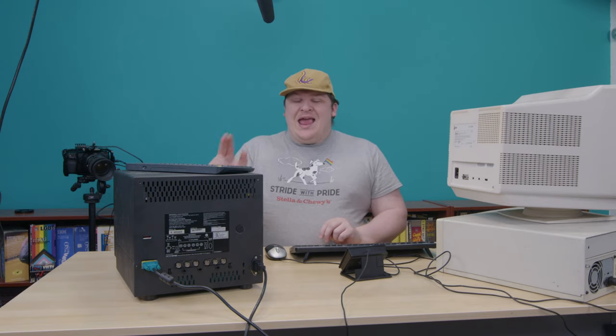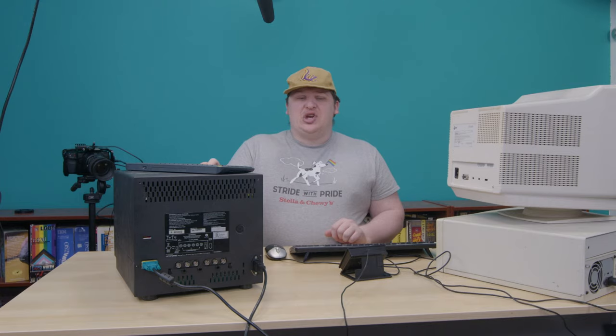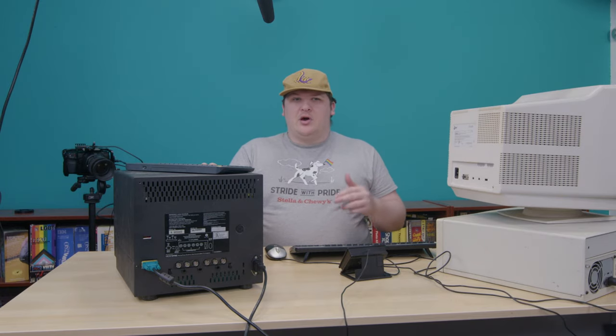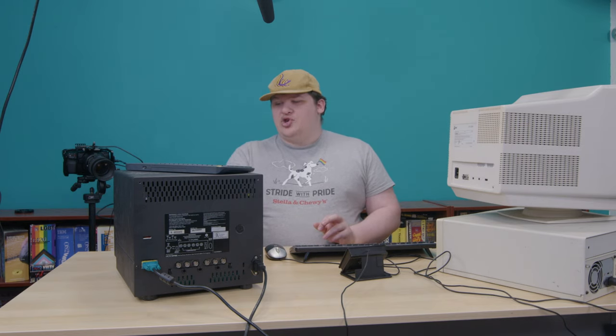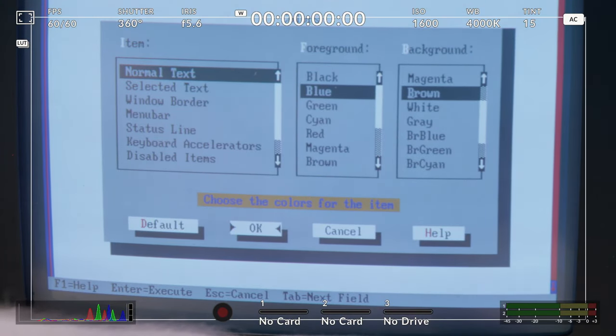And then the enhanced EGA modes, which I'll show you shortly here, use two bits for each color. So a higher and a lower bit for red, green, and blue. All digital. So theoretically, you're limited to 64 possible colors. Oh, good news. Everything is warmed up, so now it's not doing the thing anymore. Terrific.